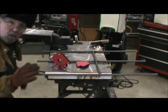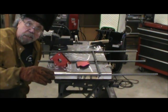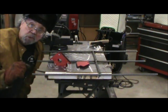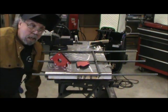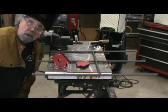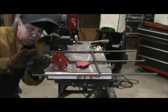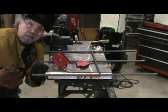When you're doing something like this, you always want to weld on both sides. If you weld on just one side and it's going to take a whack, the weld will break. So always reinforce it on the other side. Keep in mind that with some materials, as you weld, it's going to work on them — so that's another reason that you weld on both sides.